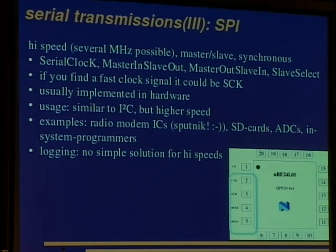But one can use a microcontroller that has 2 SPI interfaces and put the MISO and MOSI lines to 2 MISO lines of that microcontroller and put the SPI into slave mode and just sniff them. But you also have to get it into the PC some way, and this is another problem we'll come back to later.